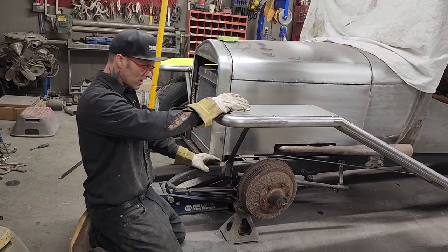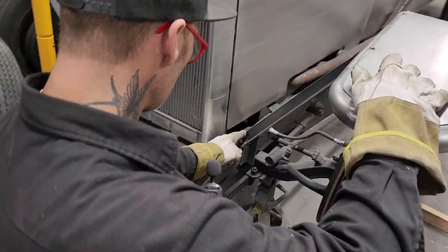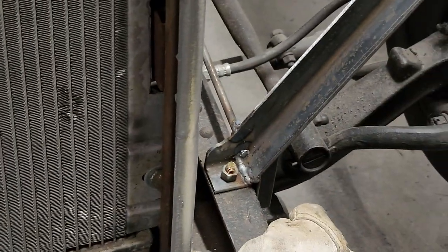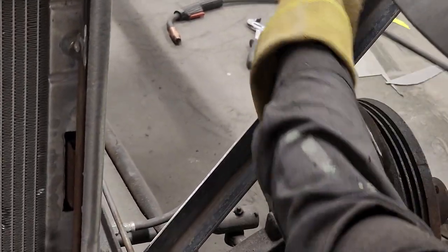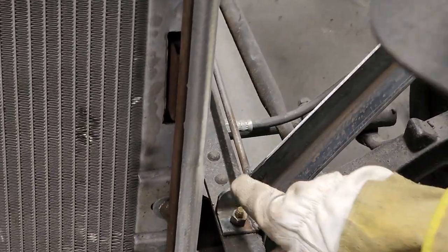As I got thinking about this yesterday, if Jolene wants to come take a look, yesterday I applied the round rod down on the bottom of this angle iron. When I put my metal on, I couldn't weld my metal on the edge of this angle iron down here. I had to weld it on the inside, or on the top, and then go down through the middle of it to get to the bottom. So I snipped it off. I brought it to the top.